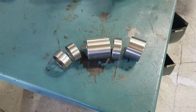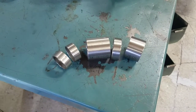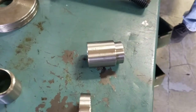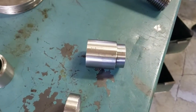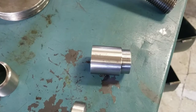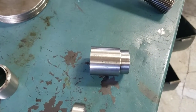To the left you'll see two other pieces — those are actually bushings that will interference fit on the inside of the tubes. The bushing inserts inside the sleeve and it's got a little bit of an interference fit, so it will slide down but it will interfere as it goes down, making it a hard slide.